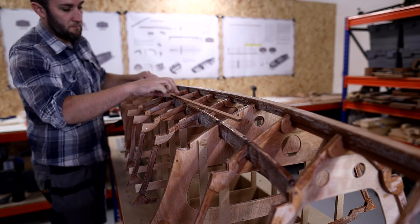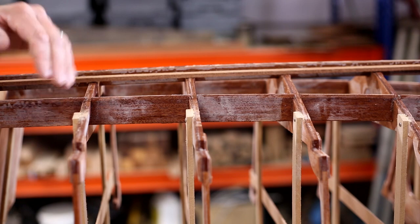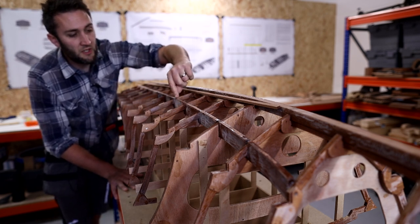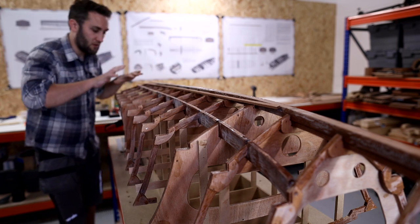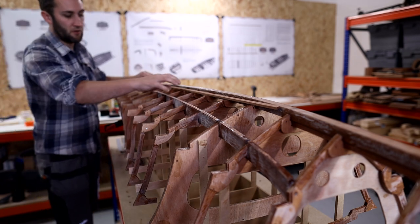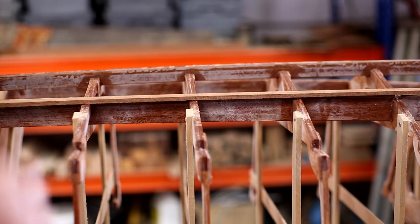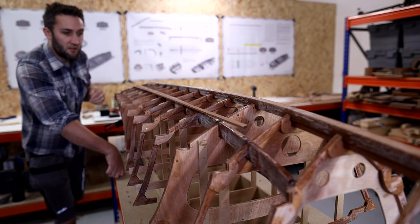We'll start with doing that on the stringers. These are perhaps the easiest to see because we've got a notch cut through for all of our frames. Our frames are going to guide the shape of the bottom of our stringers and we've got that guide already everywhere that we've got a frame cut through. We need to take the outside edge of this stringer down until it's the same height as the frame, and the inside edge as well. We can basically use the frames to mark this - I'll run a little batten along our framework and scribe a line along the side of the stringer. That will give me a continuous line all the way down the length of the stringer - a really nice line to work to when I start to plane these down.